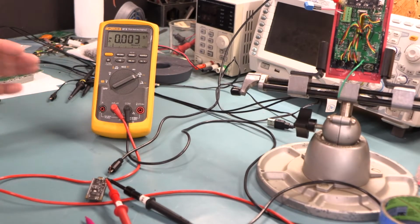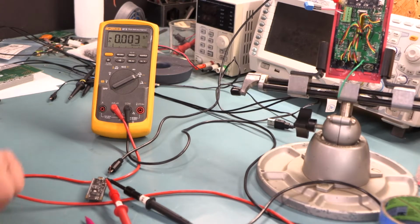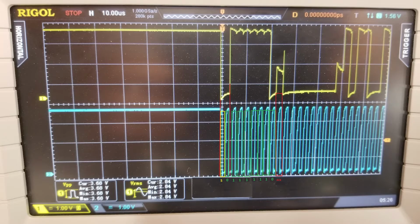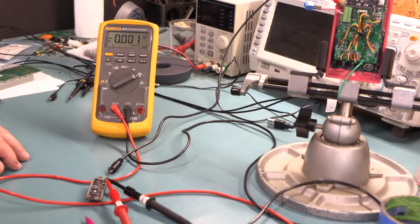I mean, that's the equivalent, right, of a 330 ohm pull-up resistor. And if you remember back when we were looking at the edge of the SDA line, and I said, see how straight the SDA line edge is, keep that in your mind. That right there should have been a sign that there was something providing a lot more pull-up current than just my little 5K ohm resistor, but I didn't catch that.